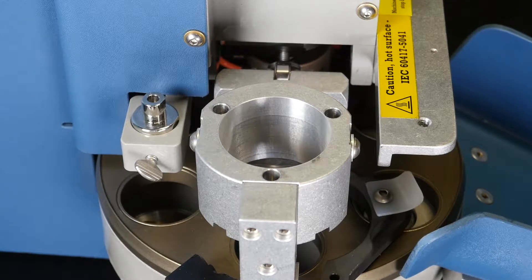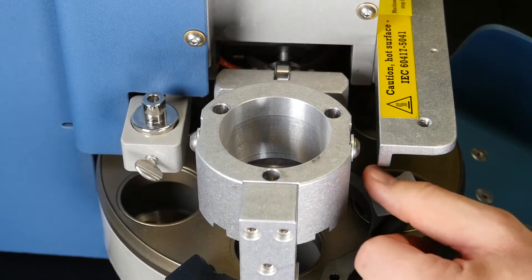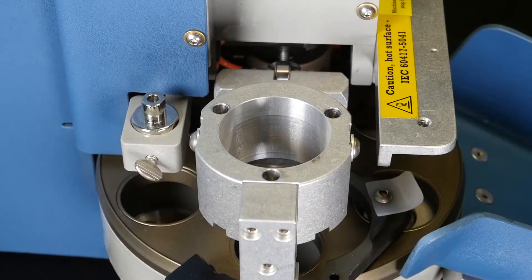If you're seeing a higher variance of cup drop or double drop issue, or any misalignment in a lot of cup jams, our recommendation would be to change the spring tabs, which are located here and here on the cup loader body.